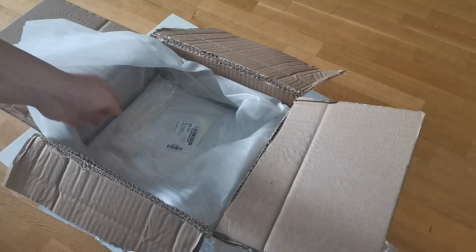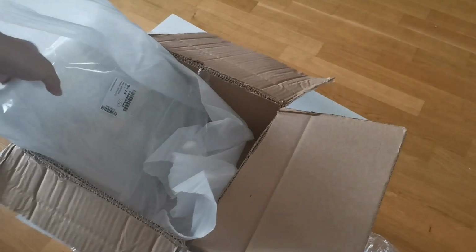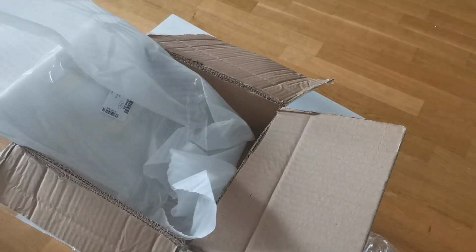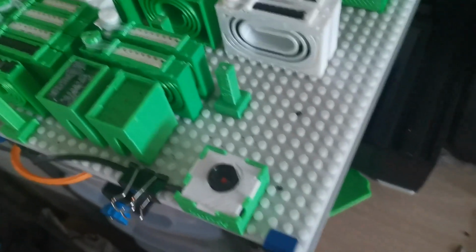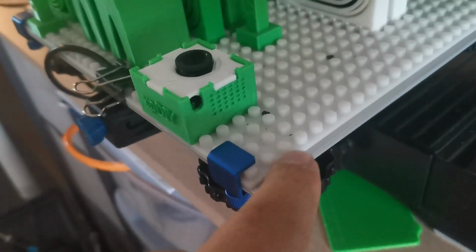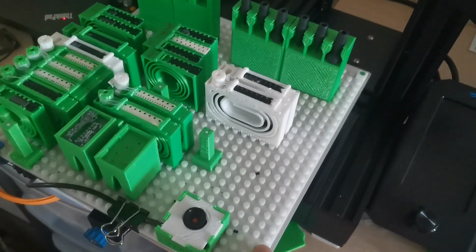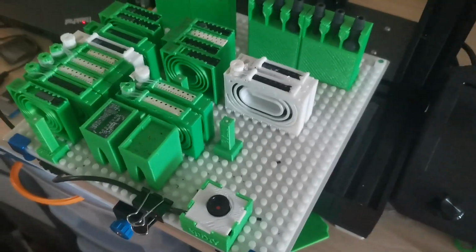Then the next thing is, remember I have this base plate, which fits my purpose. Like this one, this plate fits my purpose. But last time I built it a little bit thin here. It's like 2 millimeters here, which is not strong enough, I would say, or it's likely to bend a little bit. So this time I want to make it a little bit stronger.